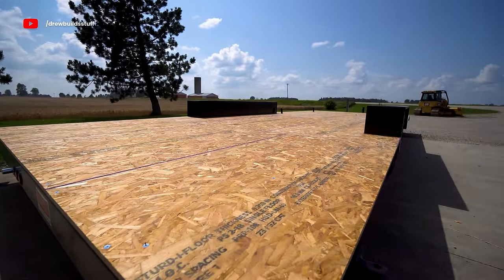And then I just want to make sure there's about a 3/8 to half an inch play in this panel up and down, because it's only about 8 degrees out when I'm filming this, and it's going to expand quite a lot once it's about 35.